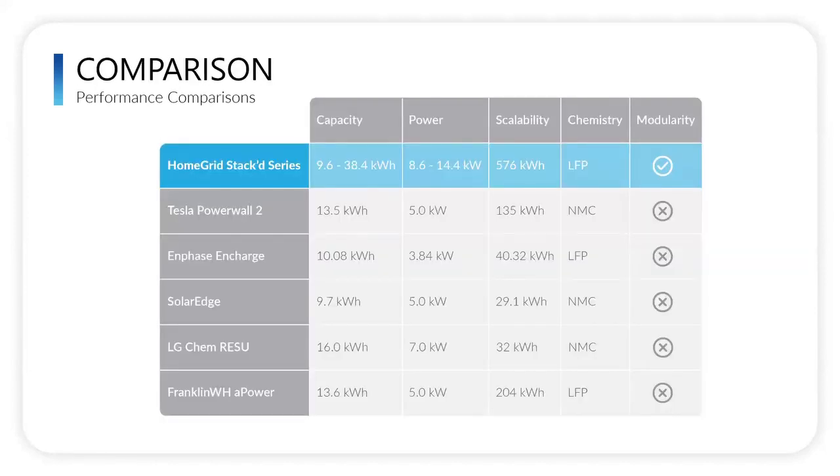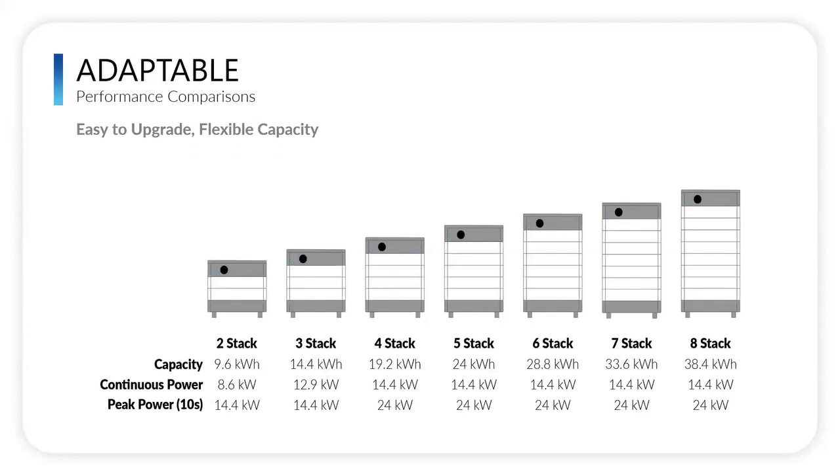The other thing about that too is we run our batteries in parallel. So if a module were to ever go bad, we have a very, very low RMA rate. I think it's less than 1%. I think it might even be less than 0.5%. But if a module were to go down in an off chance, they're running in parallel, so the battery stack is going to continue to function.